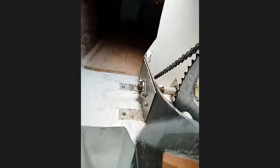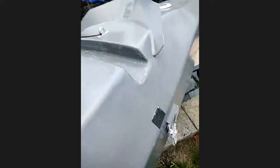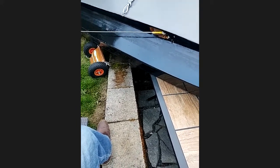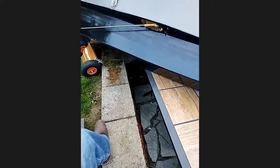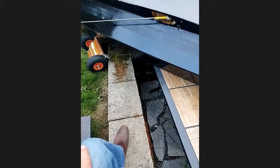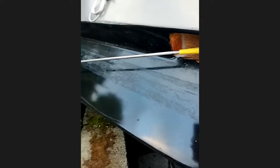You can see there's the right-angle gearbox and a little stub shaft, supported on the other side with a bearing. The whole design is a little unusual in that the main hull is really skinny — maybe 10 inches wide — and then a few inches above the waterline it steps out wide enough for a person to sit. You can also sleep inside that hull. That narrow section allows a spot where the right-angle gearbox sits out over the edge of the water, and that's where the prop shaft comes out.